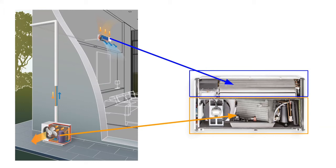So how cold do you think a unit like yours can go? Our unit right now can go to -5 degrees. -5? Oh, I thought it was up at 15 Fahrenheit. Yes, we actually made some changes recently in our board and how we control the compressor, because the speed is all variable and so are the frequencies. So we're able to go down to -5 right now.